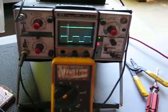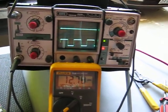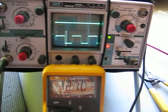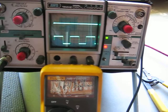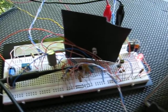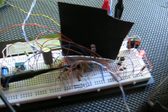This is the scope showing the PWM output I'm getting from that module right now. The module is capable of pulse width modulation from 0 to 100 percent and a frequency of 100 hertz to 7 kilohertz. It also has a voltage detection circuit that enables the output to the FET only when there's sufficient voltage coming from the alternator.